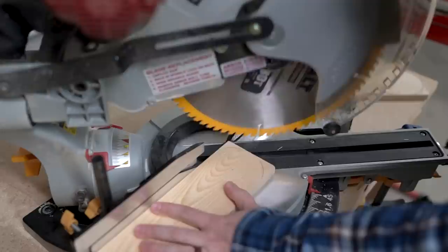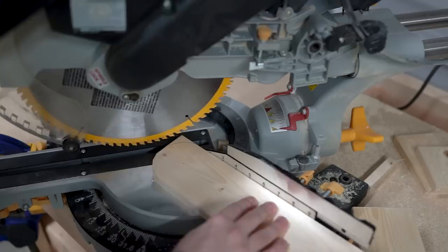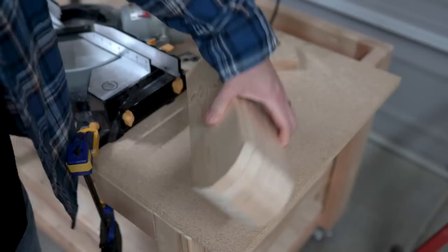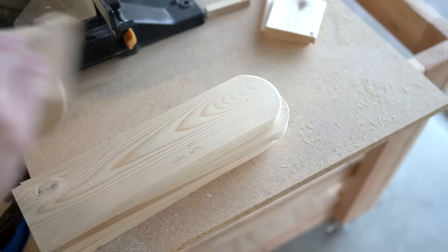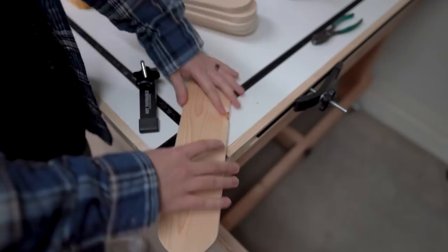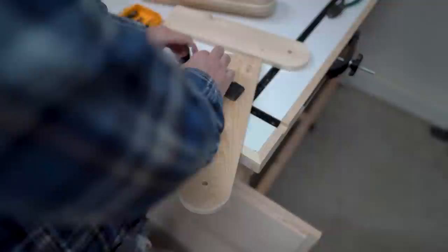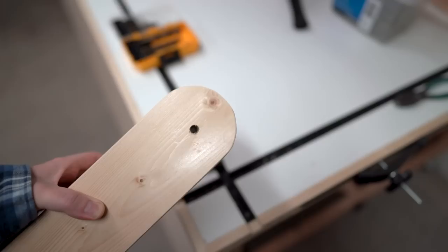As you can see, I just knock those sides off. It's not going to be a perfect cut — be careful with this, you're not going to be fully supported by your fence. Afterwards, you can see how there's some hard edges. I'm going to smooth those out with a belt sander. I just ended up flipping mine upside down and clamping it. Then I finished it off with hand sanding. I use the T-track on my bench to clamp down these swing arms and then a drill guide to make sure that I'm drilling straight through.